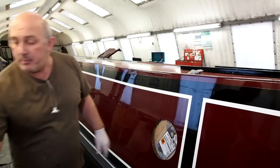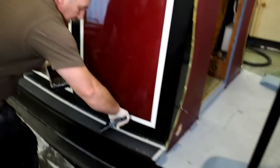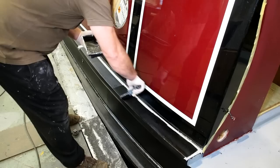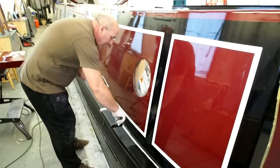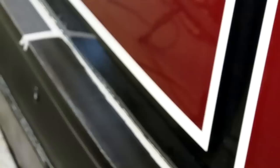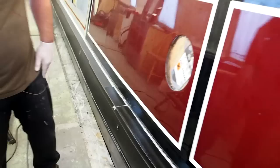I'm going to apply a coat of paint and show you how we put the sand on. We use a roller — there's no need to brush this. The roller will leave a bit of texture but we're only sprinkling sand into it, so it really doesn't matter. Just roller all the way along. You'll notice I'm applying paint right to the actual edge of the gunnel. Some people run a tape along the edge so the sand doesn't go right to the very edge — but I always worry that if you're going to slip off, you'll slip off the edge. So we sand right to the very edge, ensuring that if your footing isn't good, you won't slip off if there's texture there to support your foot.